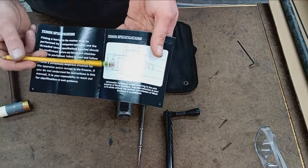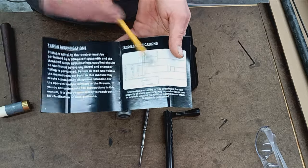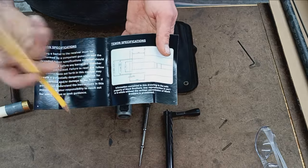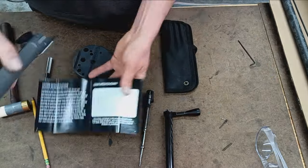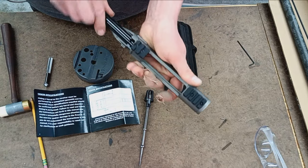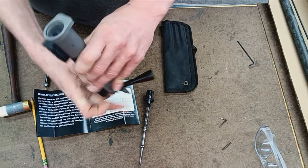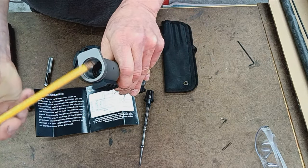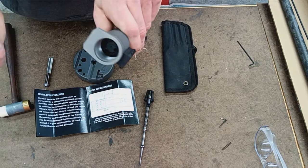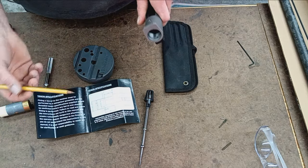So, typical Remington recess style breech. Recess diameter of .705, that's again typical of a Remington. The depth is .155, that's pretty typical as well. Thread tenon length overall is .940. And measuring this, it is actually .943. So if the bolt's in there, put it in there upside down, dummy. .943 from your recoil lug face to the bolt lug at least, back here. So it's .943. Their drawing calls out .940.